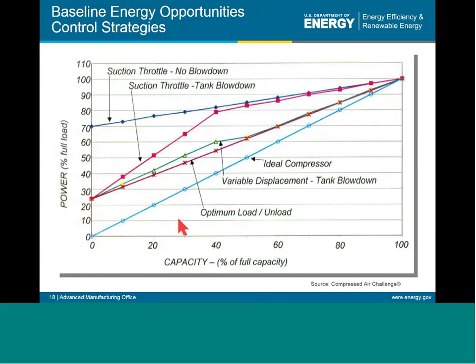The compressors, I believe, at Darigold and Sunnyside, they could be modulating compressors. There are a couple of VSD, but a modulating compressor, I think I might have some annotation here. A modulating compressor follows this line here. I'm going to make it real chunky here. And it's typically, then it'll go to about 40%, and the compressor will unload to some value here.